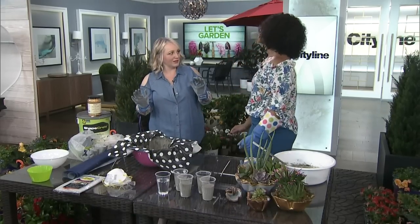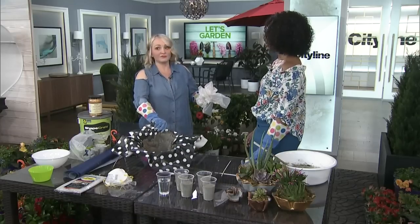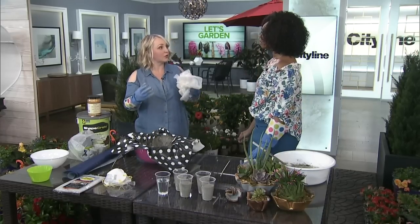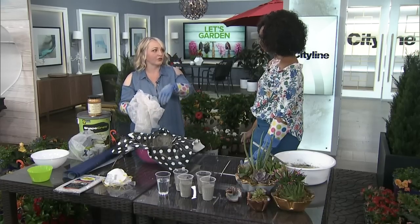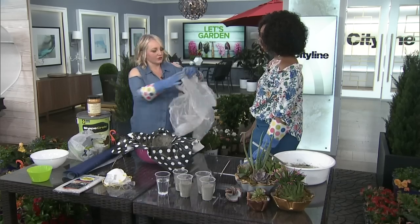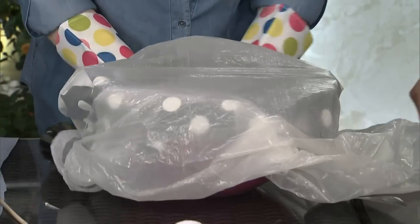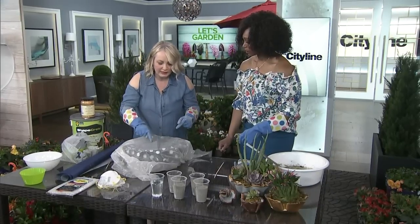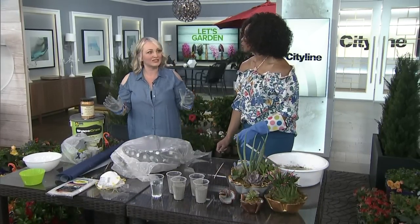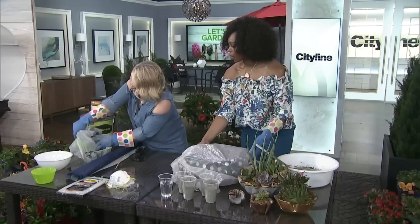Now, this is the most important tip of all, and people think I'm crazy for doing this. Concrete — most people will put concrete out in the sun to dry it. Don't do that; it's going to crack — you're going to dry it out too quickly. When you're working with a concrete product, to cure the concrete properly you actually need to do something called the hydration process and give it water. So we're going to take a little bit of plastic, cover it up loosely, and tuck this away for 24 hours. There's moisture locked in there that's going to help the concrete cure. You're going to notice beading and be inclined to want to wipe it off — don't do it. That's the magic sauce in there. Leave it alone.